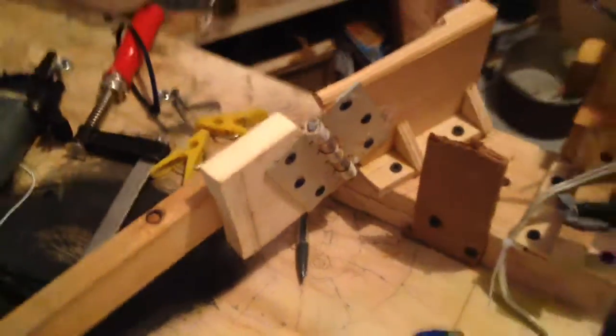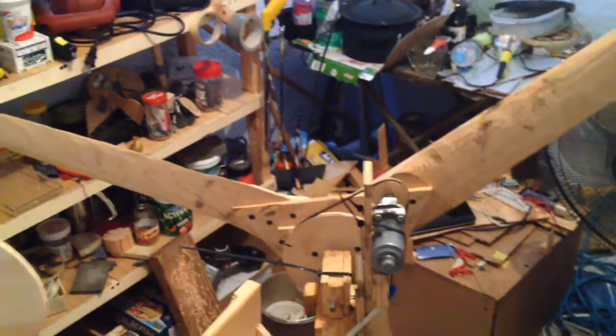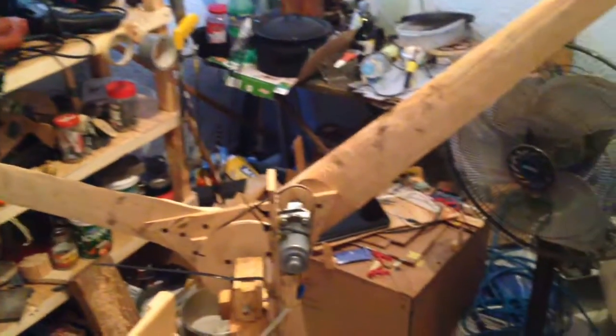This is just a door hinge used for the furling. The furling protects it from spinning too fast. I put this on my roof and it was just spinning for six hours nonstop. Whenever there was a strong gust of wind, it protects itself so it doesn't damage itself.